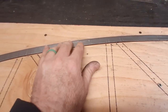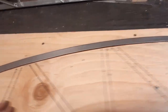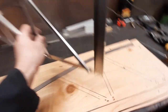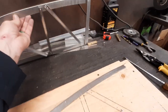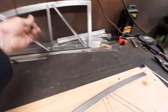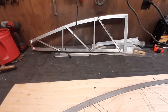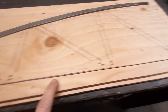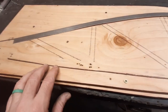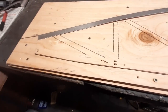Keep working it to where it drops down in there as nicely as possible. Remember when you put these braces in they will hold everything straight. If the rib is a little bit warped when you get it done, you can always shrink or stretch this edge very gently and straighten it right back out. You want them as straight as possible so your rivet line is straight and the rib is in line with it. The bottom piece is the same deal — put an angle in it, drop it in there, with a little kick-up at the back, and use the shrinker to curve it around.